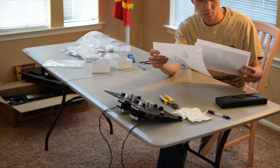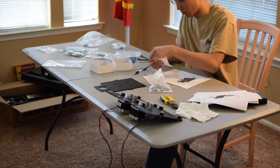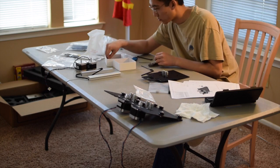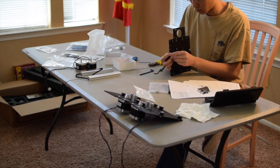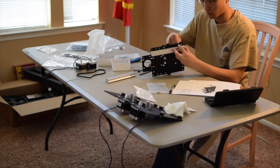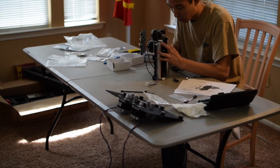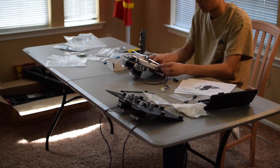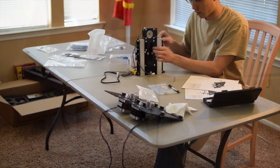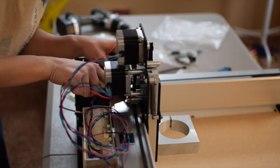Step 3 is to assemble your X-axis carriage plate. All of the same guidelines apply from before: sort your hardware before you start, add a washer between the plate and each V-wheel, eccentric nuts for the bottom wheels, and add bearings. What's different however is that the X-axis plate has both the X and Z stepper motors mounted on it, in addition to the custom Z-axis extrusions, more bearings on the bottom, and some extra spacers. Take time to ensure that your Z-axis extrusions are installed parallel to each other and squarely against the carriage plate. On your X stepper, your GT2 pulley will be installed in the opposite orientation as the other motors so that your belt can be run closer to the body of the motor. Do this before mounting the motor because there's not enough clearance to do it afterwards.